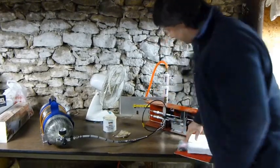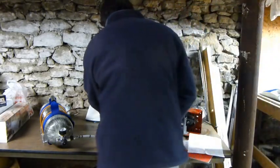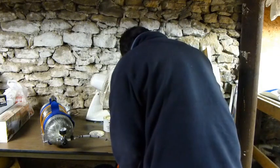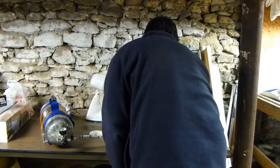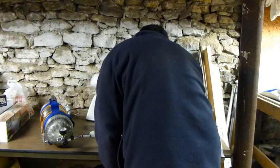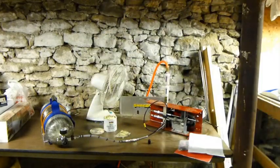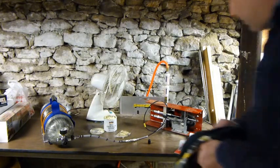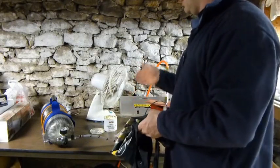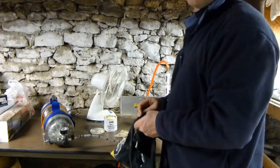We'll give you a good look at that. So what you want to do is every couple hours of run time you want to put grease on — just white lithium grease. They say don't use anything else; I've only used white lithium grease. I bought this tub when I got it. Put a little dab here and a little dab there, then just smooth it all over. You don't want to over grease it. I got an 88 cubic foot tank and I refill it at around 3,500-3,600 pounds and go up to 4,500 pounds — I put exactly 4,500 pounds in it every time.